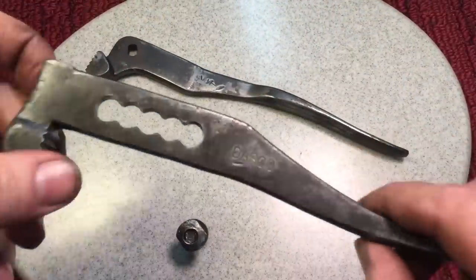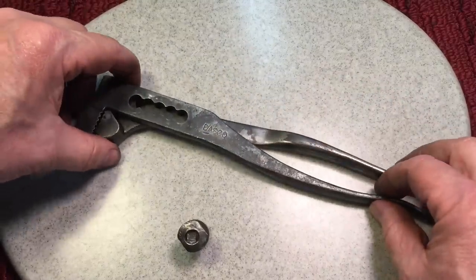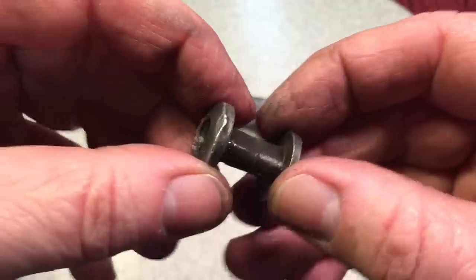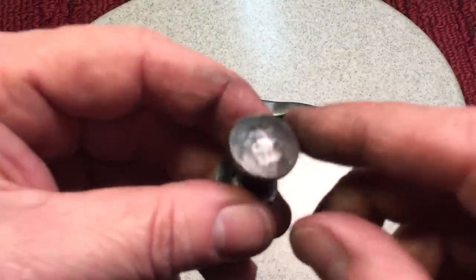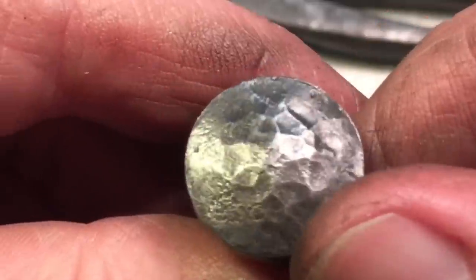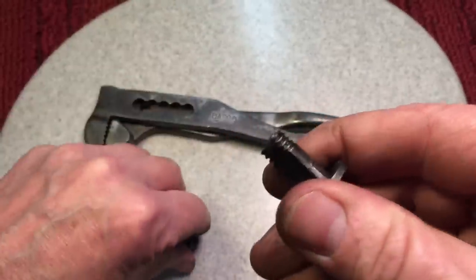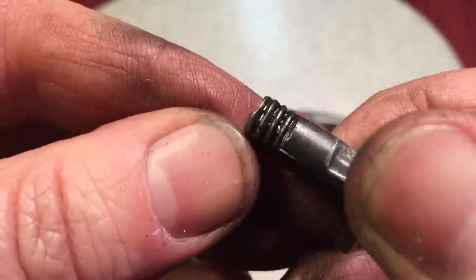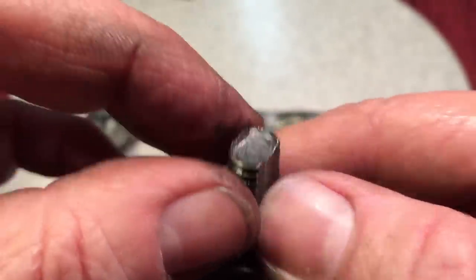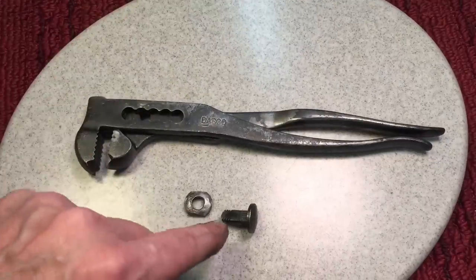Normally we do a post-wire-brush evaluation, but we're not going to wire brush this because it does have some remnants of a coating, and a lot of times they used to use like a cadmium coating. That's not really healthy to breathe in, so I'm just going to take it right to the next step, which is the grinding wheel — I have my ventilation system set up over there. I'm emphasizing a lot of work on this because if you're going to do one of these — I've done three of these before — this is your biggest issue. A lot of these wrenches will come loose and sloppy because these nuts are always difficult. That's why this one was probably peened over. Once you get this nut off, when they peen that nut down, look — it deforms the thread. So I took a file and re-profiled the threads. Be prepared to spend most of your time on this part of the wrench.